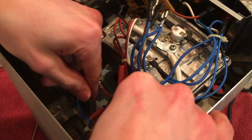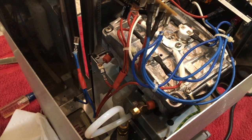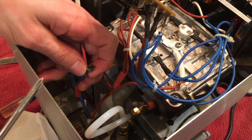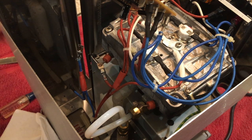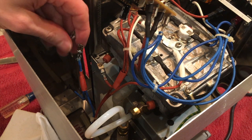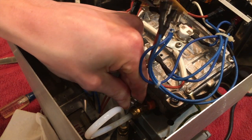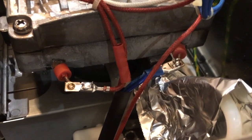The connection on the left was soldered successfully, but the one on the right is proving difficult — it doesn't want to solder well because the end itself is very fragile and coming away, so it's not making good contact with the boiler side connection. The plan is to take a new female quarter-inch spade connector, replace the terminal on the two wires leading to the right-side boiler connection, replacing it entirely with a new tight-fitting one, then put heat shrink over top to create a secure connection.